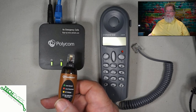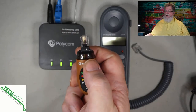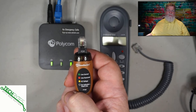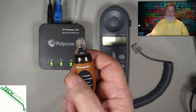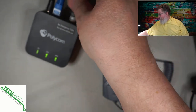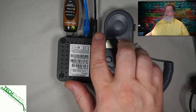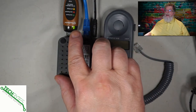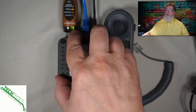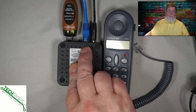It tells you if it sees the AC voltage, or more importantly, if it sees nothing lit up — like you're seeing now — because the lights you're going to see will come right up over here. That will tell you if it's not seeing anything at all, and if you've got nothing lit up, then the phone line's dead and you've got to backtrace to where it comes up to you. So we'll just temporarily take this out and plug it in on the back of the OBI 200. Voilà — you can see what's lit up right there. That tells you if it's crossed or if it's AC voltage, and at least it gives you a chance to know what's going on.